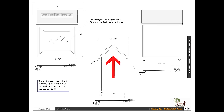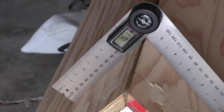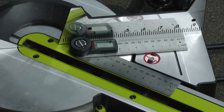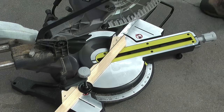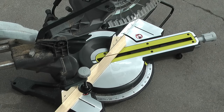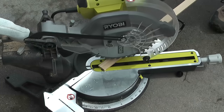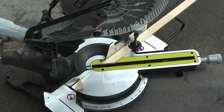The instructions don't say what the angle of the roof is, so I bought a digital angle finder to measure it, then use that information to cut the trim pieces. I placed the angle finder over the roof and the reading was 76 degrees. Half that amount is 38 degrees. I adjusted the angle finder to 38 degrees and laid it on my miter table, and the miter table read 52 degrees. This didn't make sense so I called a carpenter friend who explained: take the 76 degree reading and subtract it from 180 degrees, which gives 104, then divide by two to get 52 degrees — matching the miter table reading. If anyone can explain this better please leave a comment.